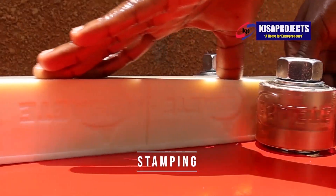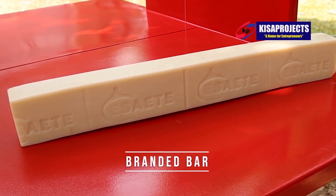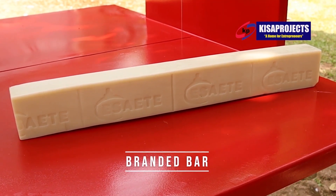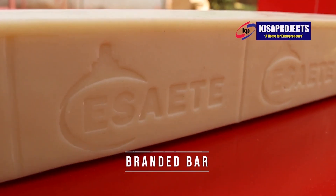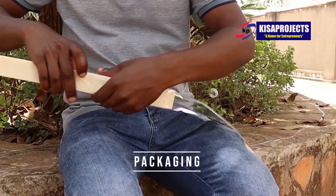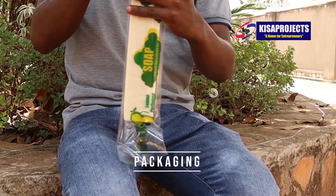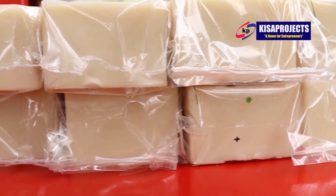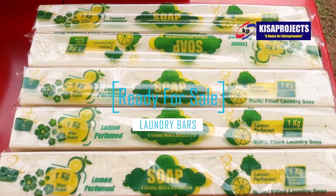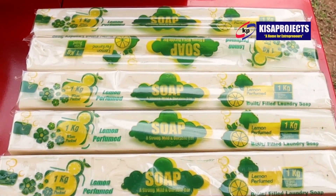Stamping. Here we use a table roller stamp to emboss the trademarks of our brand onto the finished product. A table roller stamp is suitable for forming embossed logos or embossed writings, creating a uniqueness of a certain brand from others. A finished bar of soap is manually pushed through the two rollers on the table, and as the rollers keep rotating by the force of the soap bar passing between them, the entire artwork of the stamp is embedded on the soap surface. The table roller stamp is mainly used to print the logo and soap name.